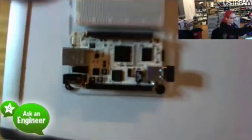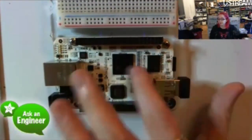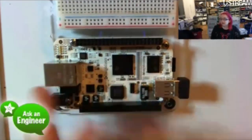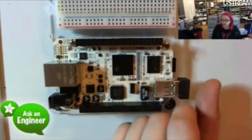And the best part is that this chipset is easy. You don't have to reinstall the kernel or redevelop a kernel for the BeagleBone. It's supported from the kernel inside. You just have to install a module, and it's really easy using opkg. And so you just have to connect to the Ethernet for 5 minutes to download the package from the internet.